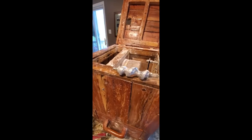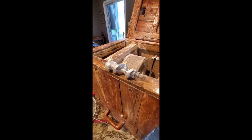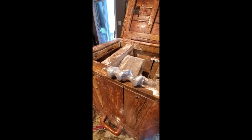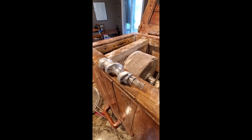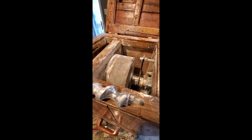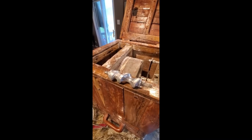Next step is seeing whether this thing actually grinds grain. So this is an auger to pull the wheat into the hole that feeds between the grinding stones, and it is from a meat grinder - it's aluminum. I had to grind it down to make the specifications and make it fit in the hole. It's got a threaded end which screws into the other end of the shaft that I developed - I actually had to drill and tap a hole in the shaft by hand. But there it is - that's how we pull the wheat in between the grinding wheels.